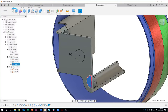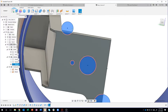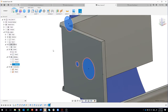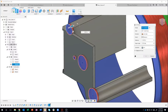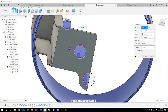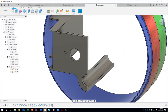I tend to select all of the profiles — I don't mind cutting away air. If this face was slightly tapered at one degree, it's much better to machine a bunch of it away than just a tiny profile. I'll go ahead and extrude to punch those holes through.